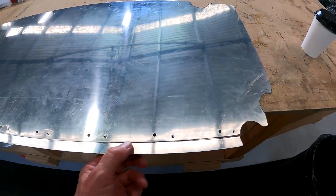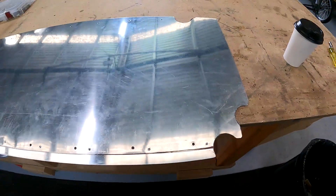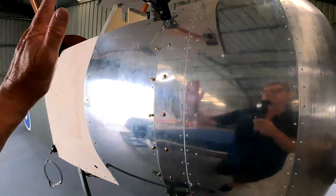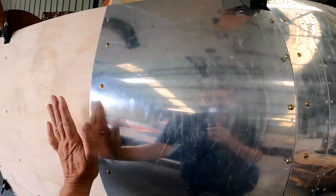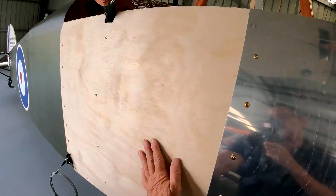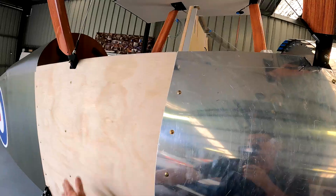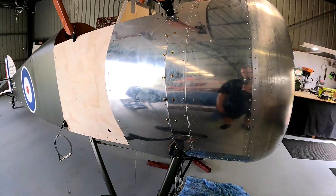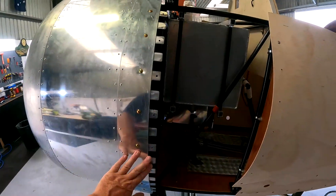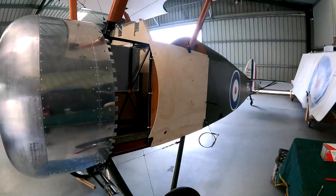Although it's pre-drilled now, so it should be alright. I'm just going to take out these two - possibly three, probably three - rivets, and trim that sheet metal. The cowl's just overlapping now that it's all nice and tight and right. Really happy with the way this is turning out. It adds a lot of strength. My plywood's all dried from yesterday - it should have a little bit of a memory. It has raised a few machining marks, roller marks. Nothing that a bit of 400-grit won't fix, but that'll be final finish sort of stuff. We'll get this side today, get this panel fitted.